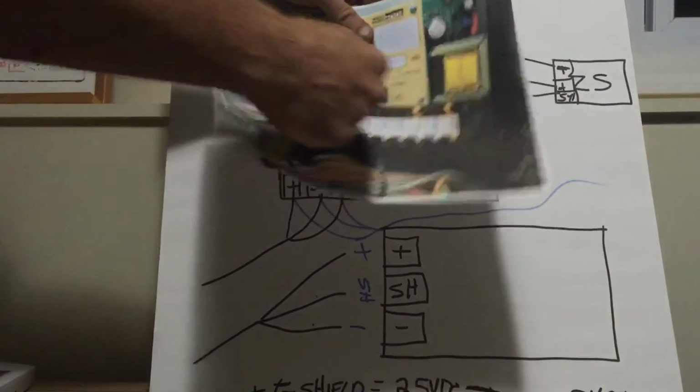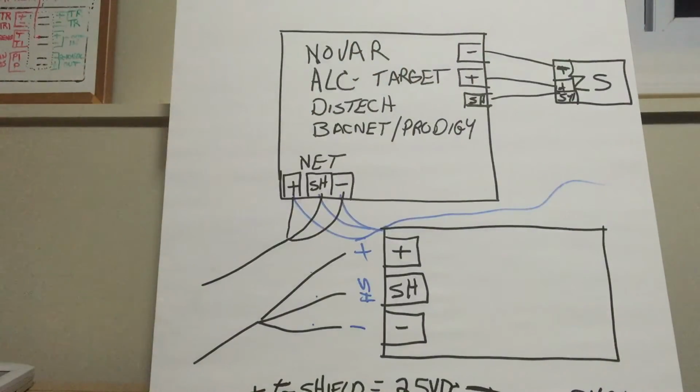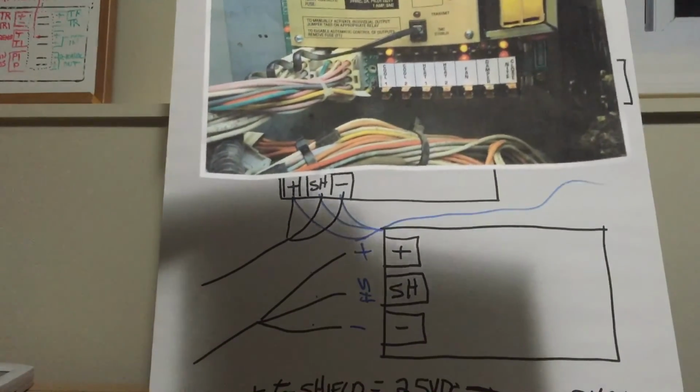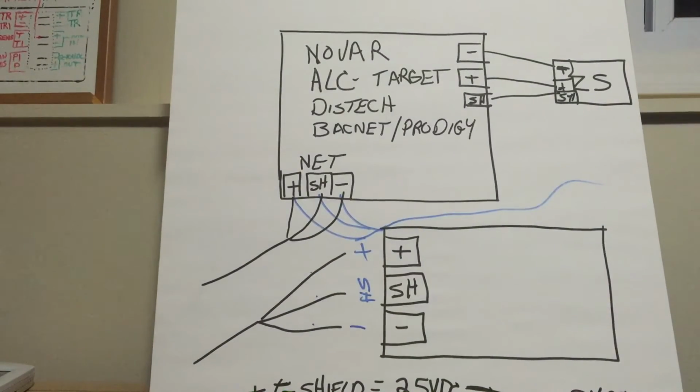And when you do that, if all the lights start coming back on, you know you've got a sensor that's shorted to ground. Again, it's got automatic ground fault built into it. So if you're putting in board after board after board and you can't figure out the problem, know that it's got onboard ground fault, and it will shut the board off if it senses a ground fault.